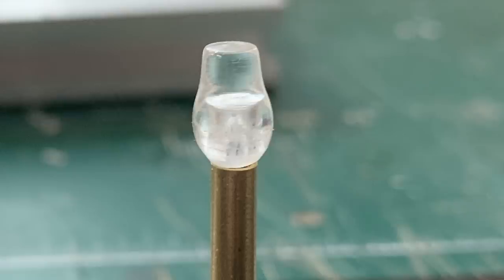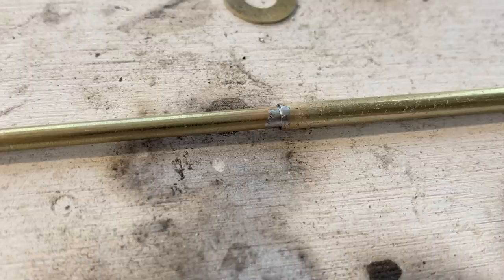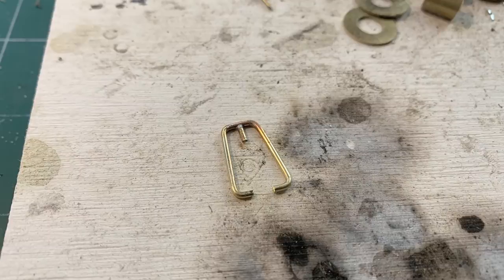So this is, of course, the smallest brass tube, and then more brass tubes will be telescoped over the outside of that, soldered in place, and then just like on the Dietz Pioneer, I will turn this down on the lathe. But first I'm going to solder the telescoping pieces together, mount the whole thing in my lathe, and there it is. Oh, look at that. That's so neat. Yeah, it's not quite as smooth as if it was made on a real lathe, but it serves the purpose. This is the one, again, that mounts through the top of the crate, hence the extended bottom on there. All of that area below the line will actually extend inside the wooden crate and serves just to mount it to the wooden crate.